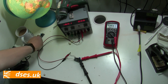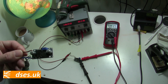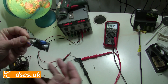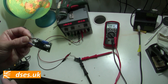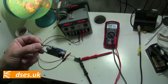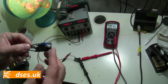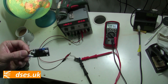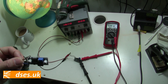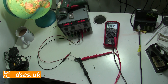How it works is quite interesting. It's rapidly switching on and off, and when it switches on, the rising current causes a voltage to form across this inductor, which opposes the source voltage, reducing the voltage at the output. As the current stabilises, the voltage across the inductor drops, causing it to rise at the load. But energy is now stored in the inductor's magnetic field. It then switches off before the current flattens out, causing the current flow to decrease and the input voltage to drop. The collapsing magnetic field of the inductor then induces a current, which now discharges through the load. It happens so rapidly that the load is either being driven from the voltage source or from the inductor, but the average output voltage is always below that of the source. That's highly simplified, so haters don't hate — you'll find some electronics boffins who can tell you more on this very platform.